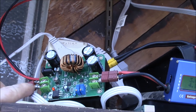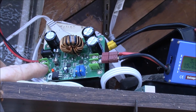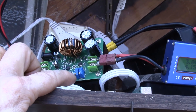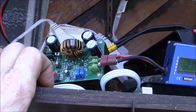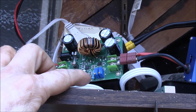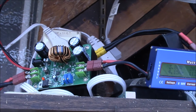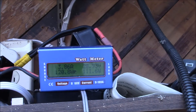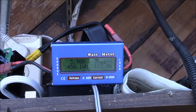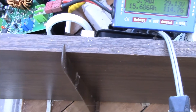Here's my little DC boost converter — I put a little Dean's connector on the input, and you can see the little red lights on it saying it's getting power. I've set the voltage to 38.5 volts, which matches one of my solar panels, and I've set the current to about 4 amps. The output is wired into a little watt meter, reading just about 4 amps output, about 29 volts, 112 watts.